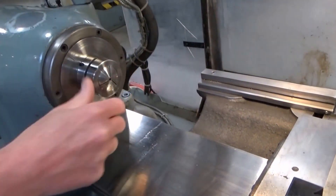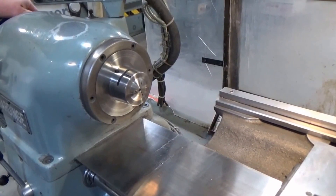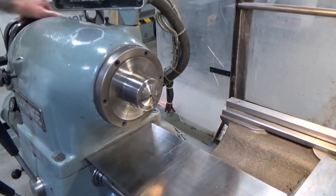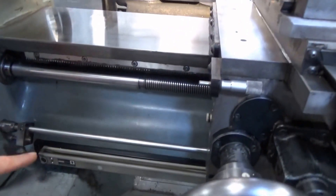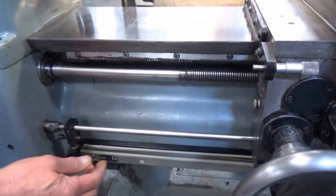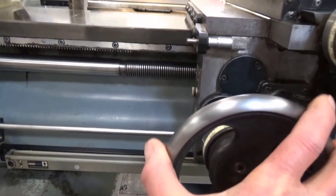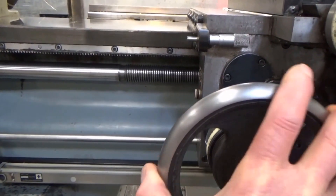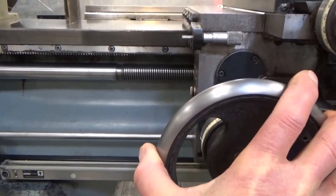Not too much wear and tear on this thing at all. On a low speed it's hard to turn, same thing up front. Lead screw looks pretty good, threading package all looks pretty nice. Our feed lever — it does have the stop dogs on it too for kicking out the threading. Rack and pinion is pretty good here. That's not worn at all.